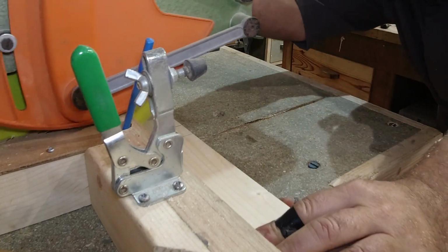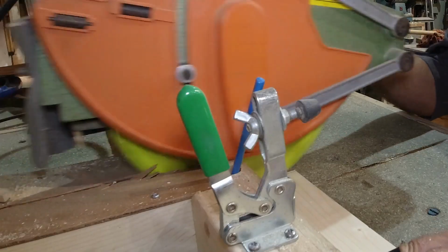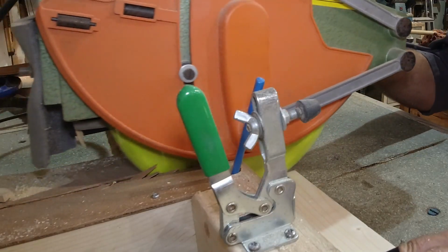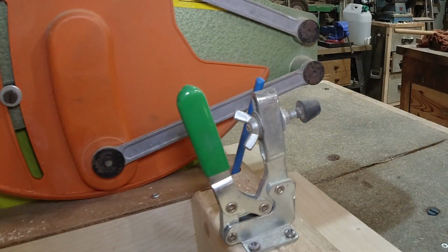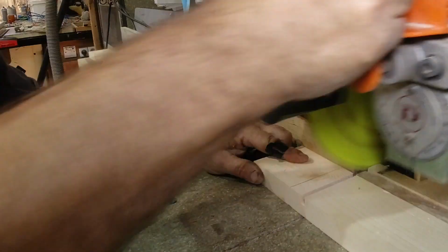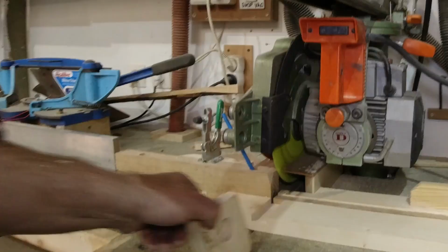It's a housing joint, so it will then prevent the pieces of wood which are going to make the knuckles from being able to move or wobble about on the actual backing plate. It makes it stronger. I won't need any additional reinforcement. These are good old saws. These radial arm saws, it might be old, but it's a great machine. I really like it. So back to the old bench.